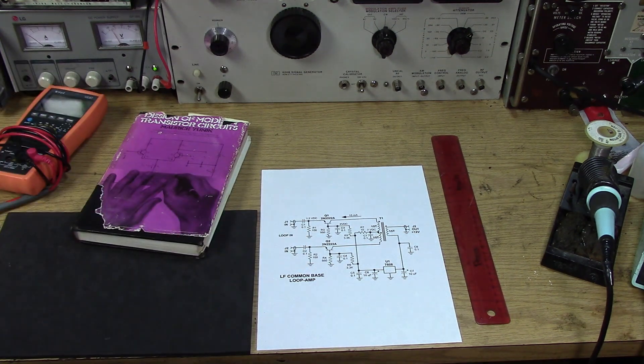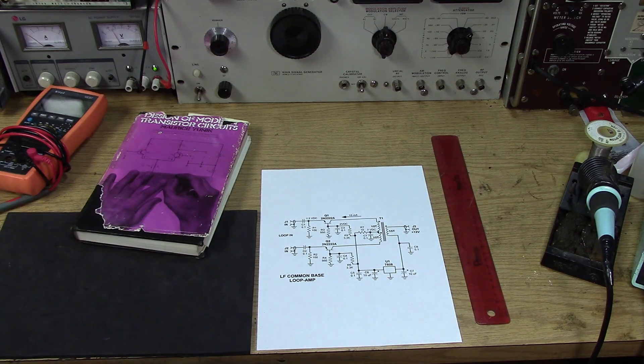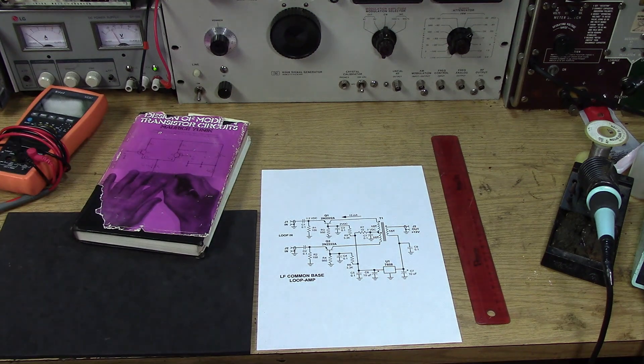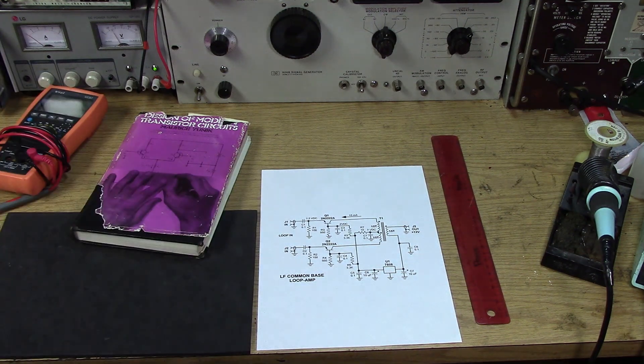The amplifiers — I'm going to use two 2N2222s. I'm going to bias them very heavily, around 15 milliamps at 8 volts. So they're going to be dissipating about 100 milliwatts each. Those guys are going to get a little bit warm out there, but I think they'll be happy at that level. And of course, up here in New England in the winter, it'll help warm up the box a little bit.